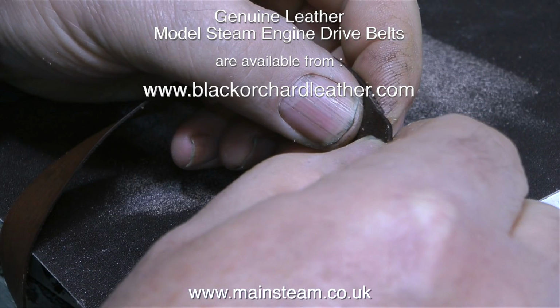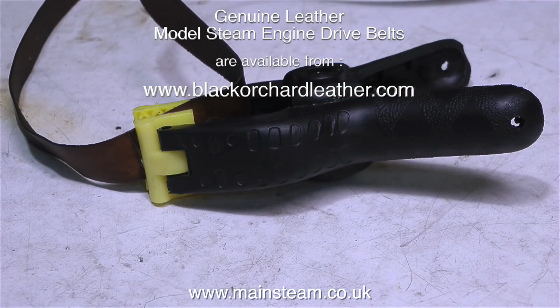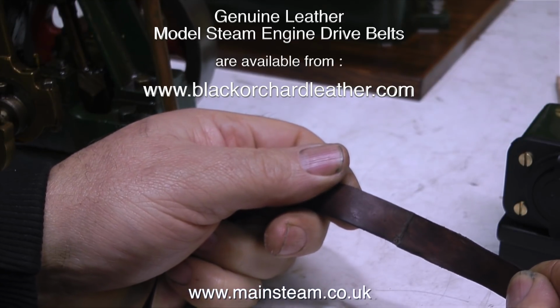I'm using some coarse sandpaper to first of all sand one side of the leather at one end and the other side of the leather at the other end, and this forms a tapered section of the piece of leather belt at each end. And once these two tapered end sections of the leather belt are stuck together, I will get a very strong joint.